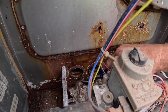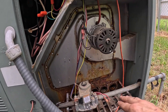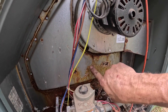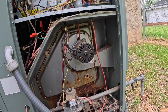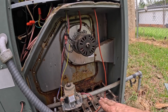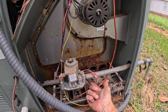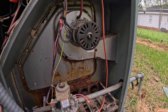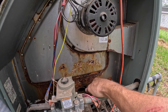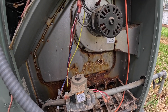See that water right there — that's kind of designed to do that, because when it's blowing cold air over these tubes, the tubes are warm, so water condensates in the tubes and rolls out up here inside this collector box and rolls out down here. If the package unit is not level — if it's tilted back just a little bit — that water won't run out, and the first time you fire up the furnace it'll trip on the rollout switch because the tubes are full of water. So they have to be level, and sometimes you can just burn off the water — boil it off by forcing the furnace to run — or you have to suck it out with a wet-dry vac.